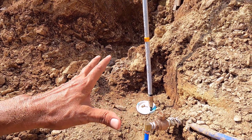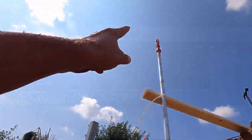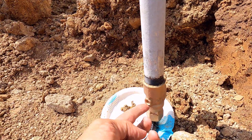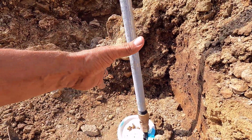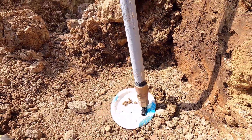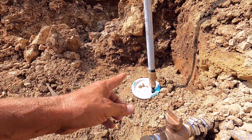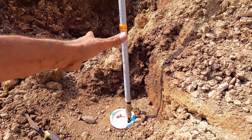For those of you who've never seen a yard hydrant before — when you close it up there, it has a plunger that comes all the way down right into this area. When you close it, all the water drains down through this pipe and comes out this hole. That's why this is going to get wrapped separately in the landscape fabric and then the entire thing with the gravel, so it has an easy place to go and this little hole never gets plugged up. I also have to get the PEX on here and crimp it and test that for leaks first before I seal everything up. Then, once that stuff's all leak-free, I can get everything sealed up.